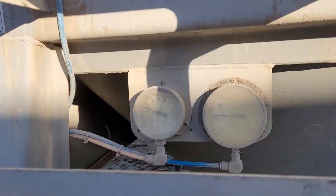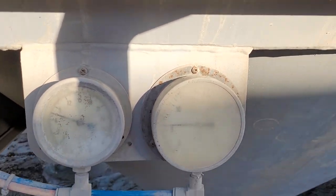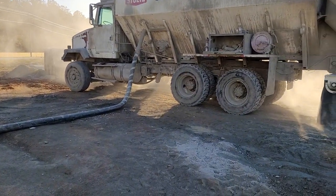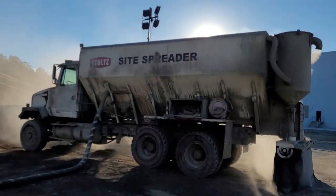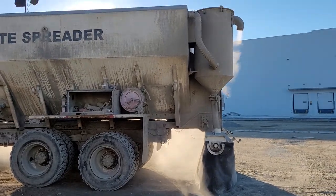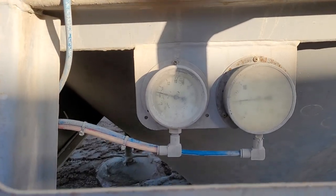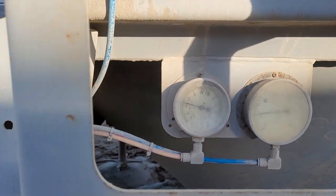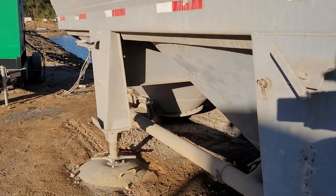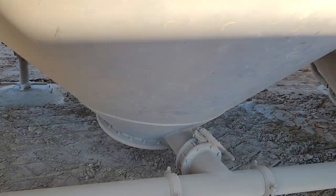You've got line pressure and you've got tank pressure. It doesn't take a whole lot to push cement into a truck, because you're not blowing it up into a silo a hundred feet in the air — you're just blowing it into the truck. Five to seven pounds will do it. As that tank starts getting empty, the pressure will start falling, so you close that valve and open the next one over, to keep the cement from dropping over the divider.